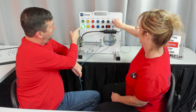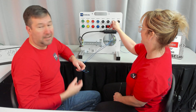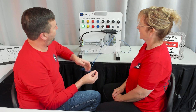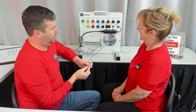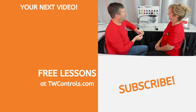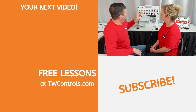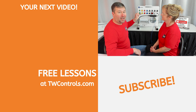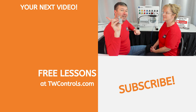We're going to take a wire to the plus 24 volts. Now if we switch switch three to the left, our green light comes on. If we switch it to the right, our green light does not come on. But we have our auto — if we touch our two wires together, that is going to let us remotely operate this. With both wires touched, we'll switch switch three back to center and that's off. Amber, you brought up a really good question about whether polarity mattered — on this particular light it does not, but on this relay it does.